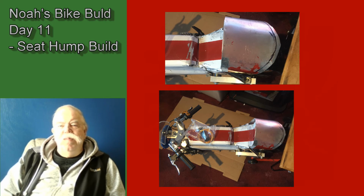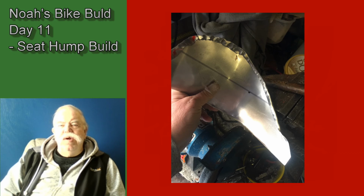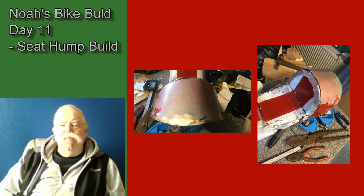Shape decided, cut off the excess, bent it for this safety edge, went into the garage, used my large vise to tap this safety edge flattish. I find that the more I tap it a tight bend, the smoother it feels to the touch.